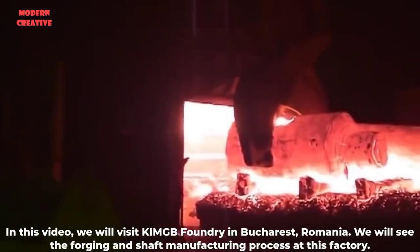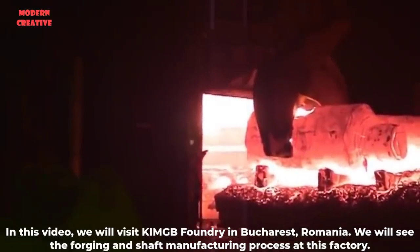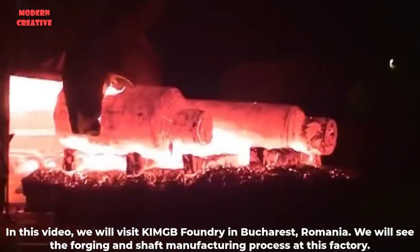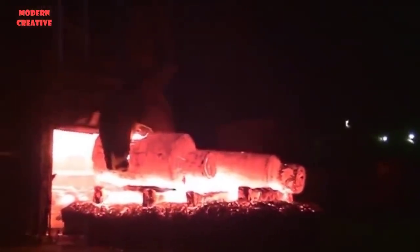Friday morning, about 4:30. We're pulling the ingot out of the furnace. Next phase of the forging operation, we're going to upset the material on the 12,000 ton press. You feel the heat from here real good. Taking a heat reading on it, and now they're going to go ahead and carry it to the press.